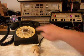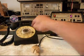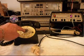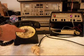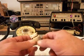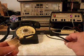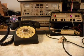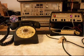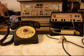Another thing that we want to look at is the rotary. I want to make sure that we clean and oil that and get that adjusted. We want to get a center card and cover in the rotary. Another issue is his modular plug that somebody has put on the original line cord, and we'll get that squared away. He's got a note here about the year, and from the date code it looks like about 1959, and he's also saying his bell does not ring.